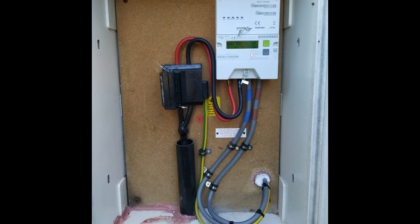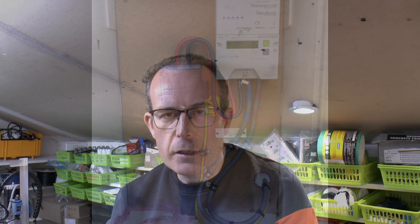The white sealant on the end is a fire sealant — one of these intumescent types, so in the event of a fire it will swell up and stop smoke and flames going through. Significantly upgraded, but it just shows that existing cables can still become defective even when they were put in correctly to start with — in this case due to the insulation being added afterwards. So that's it for this video, and until next time, thanks for watching.